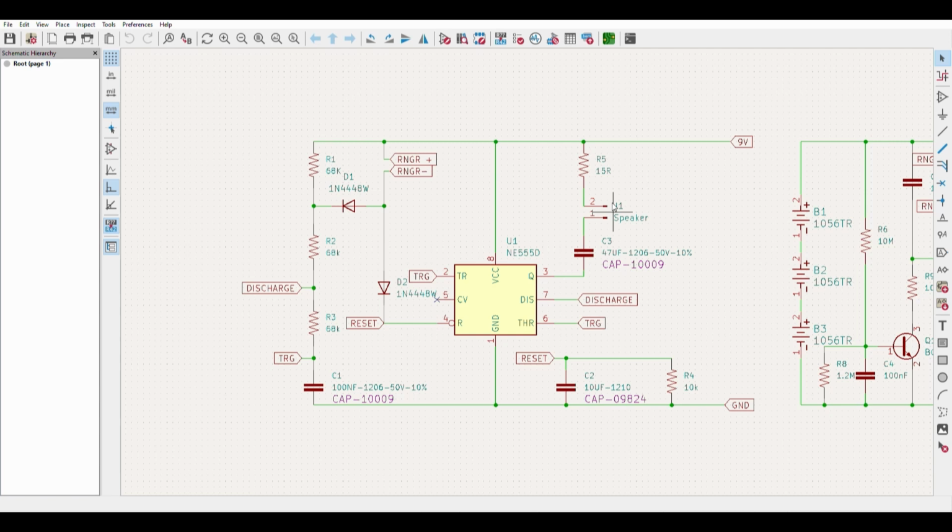So once the button has been released, R1 is once restored to the circuit, which changes the frequency of the 555 timer and allows for a lower or secondary tone, hence the term ding dong. So C2 starts to discharge via the 555 timer on its reset pin and via R4 to ground. As the discharge is occurring, the voltage drops, and quite soon the voltage drops below the 555 timer's reset voltage, and the voltage required to keep the oscillation going. So the tone coming from the speaker ceases and the circuit is ready for the next press.